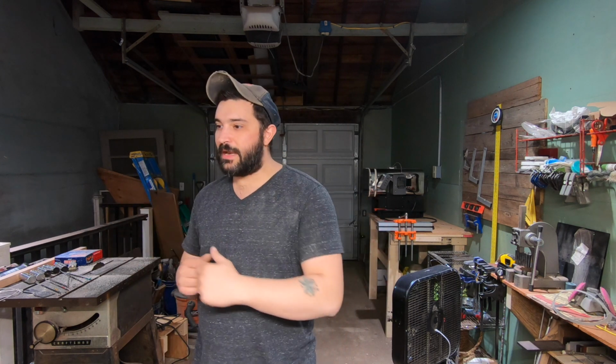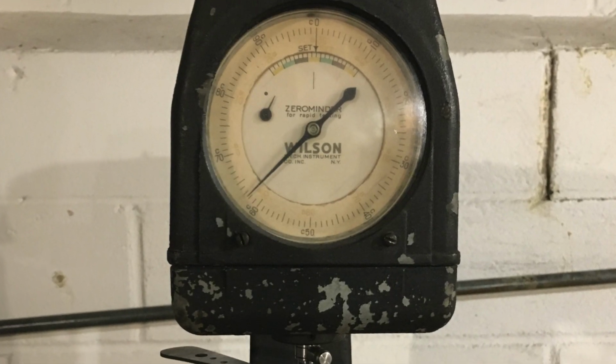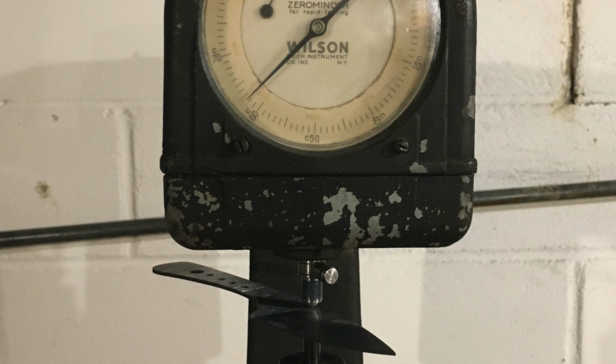After that temper, I ground off the decarb of one knife, actually this knife that I'm going to show you. I ground all the decarb off and tested it again. It was at 62 before, I got a spot on there, and it went up to like 63. So 62, 63 after the cryo and the temper. Then I did a second temper at 925 for 2 hours and got all the decarb off. You saw in my Instagram post, and I'll post a picture of it, it was roughly between 63 and 62. I'm going to call it within the 62 range.